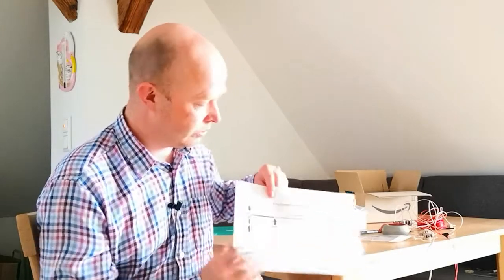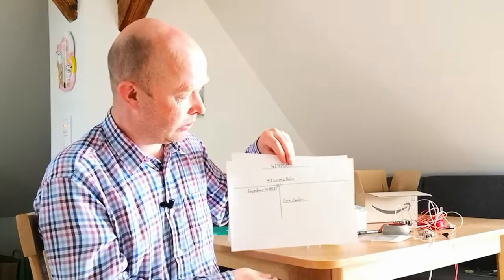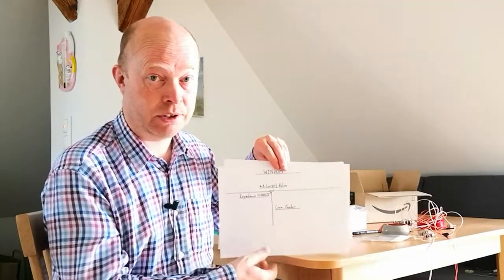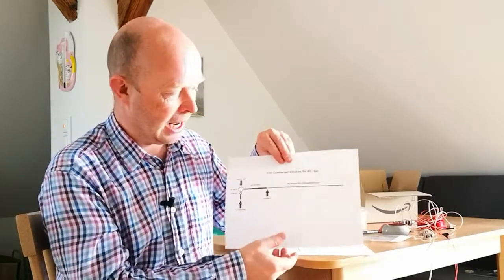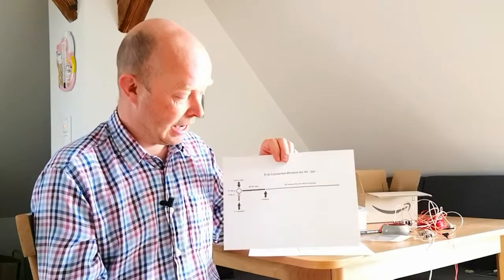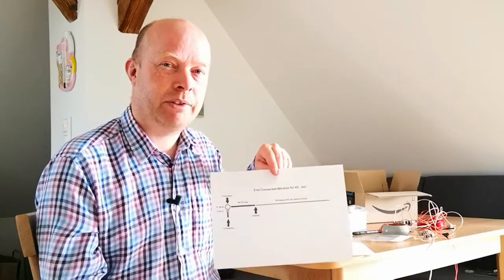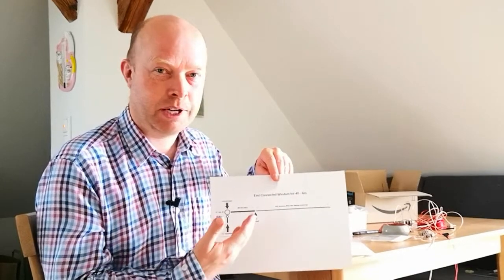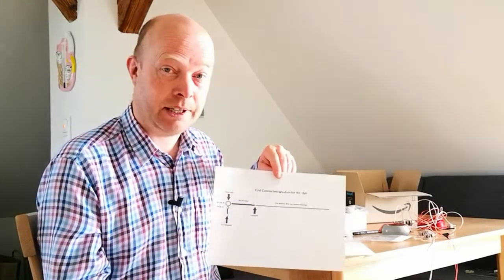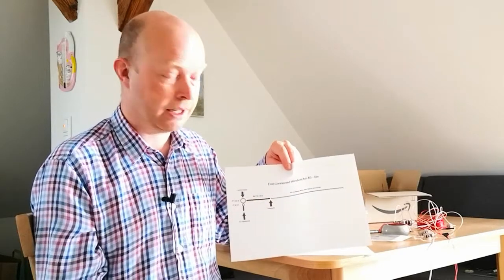Just one note before I move on. You'll notice we've got the feed point here, and you'll say, well, hang on. In a normal Windom, we've got a 4-to-1 current balun here, and that obviously reduces the impedance down to about 50 ohms, so in some cases you don't need a tuner. In this antenna, the End Connected Windom, you'll notice there's suddenly no voltage balun at the feed point. That means that our feed point impedance will stay at 200 ohms. Now the thing is, it's not a problem for the KX2. The KX2 can easily transform 200 ohms, even more, maybe even 1,000. So there's no reason to carry another balun when the internal ATU can take care of that transformation. The only thing we need is a current balun here to stop the RF flowing back to the rig. So I don't do it.